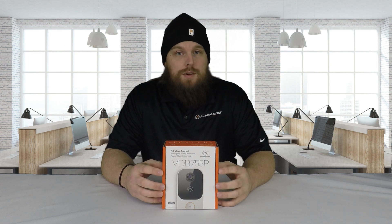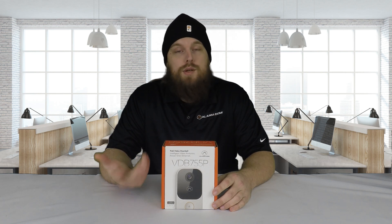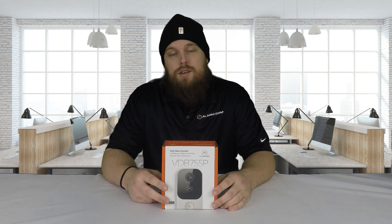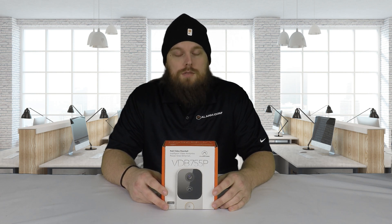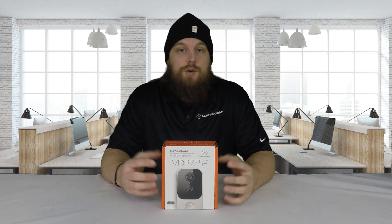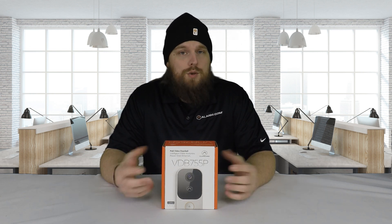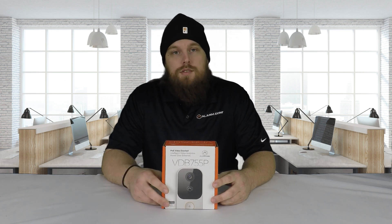It can be quite difficult getting an Ethernet cable fed into where you need a doorbell if you don't have one built in already. However, depending on how your doorbell and the wires were run originally, you may have enough room to feed one in. Generally, though, you'll probably have to remove some drywall to be able to access that location. So it's generally best if you plan on this if you're building a new home or if you have your walls open for any reason. And if you do plan on connecting it to an SVR, make sure that you route the cable so that it can reach that SVR without too much trouble.